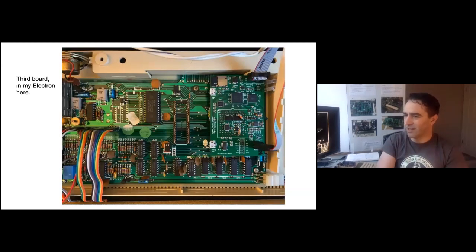So I made another one — here it is in my Electron. Thank you to Dave Hitchens, who gave me this Electron, a Plus One, and a Plus Three, so I could test everything. Eventually I decided to get the SDRAM working properly — figuring out all of the crazy clocking stuff you need to do to get it working at the actual rate of the FPGA — spending much time learning about set input delay and set output delay for FPGA people. This brings us to early December last year. I pretty much haven't touched this project since, although after writing this talk, I realize there are all sorts of interesting things I can do with it. Most annoyingly, those BGA buffers — basically the reason I could make this board fit — have been discontinued. So I'm going to have to replace those with something. There will be another spin of this board.